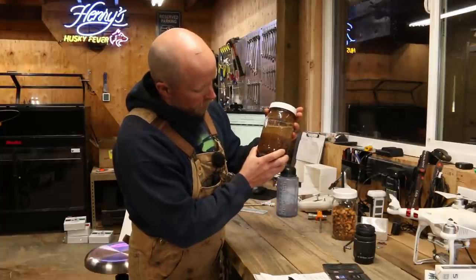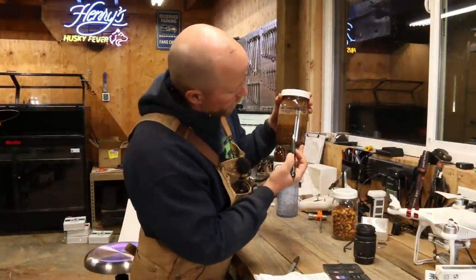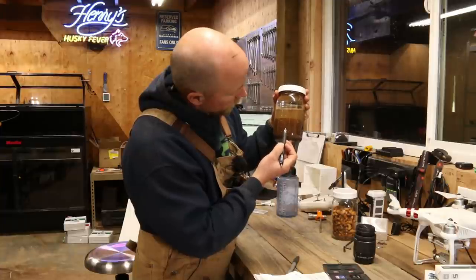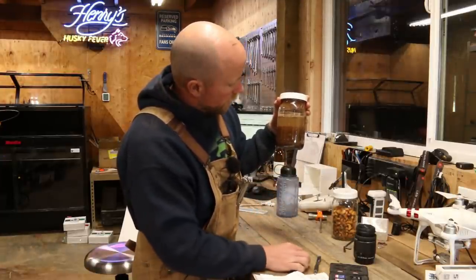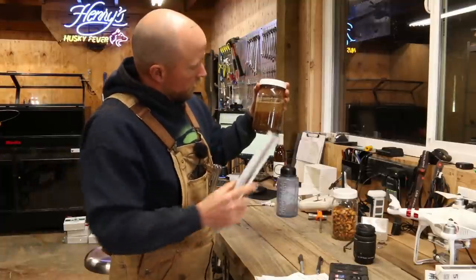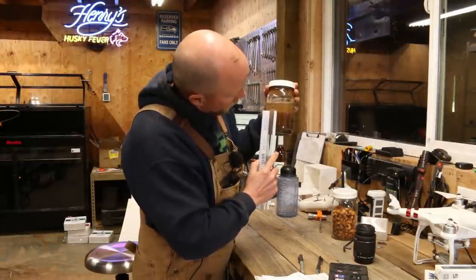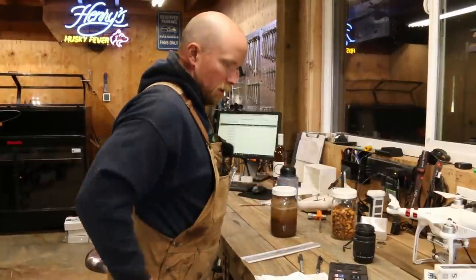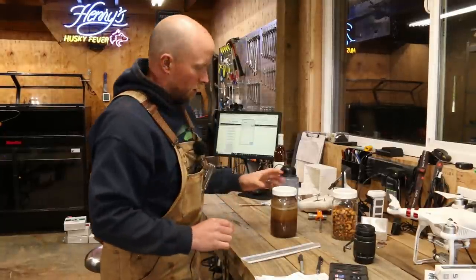It's been 24 hours and the dirt has settled. There's no good way for me to show you this, so I'm just going to point — there's really no gravel or anything in this dirt. All the heavy stuff settled. Right about here is what is probably clay. That is about a half inch, and the whole thing is about two and a half inches. So a half inch of it is clay out of two and a half — that is 20% clay.